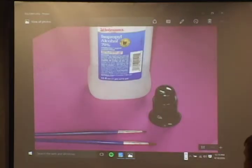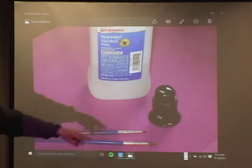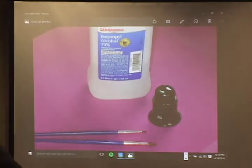You can do some cleaning yourself. One thing to watch out for: if the player hasn't been used for several years, if there's any deposit on the stylus tip, it's probably hard, and the disc and the stylus cleaner won't take it off. So take a look at the stylus underneath the magnifier. There's a 10x magnifier here. You usually can clean off the stylus tip with a fine artist brush and isopropyl alcohol. This works wonders for me 60% of the time. The other 40% is when you send it to us at CED, and we've got some special solvents that do that.